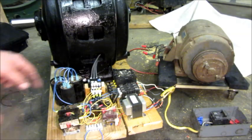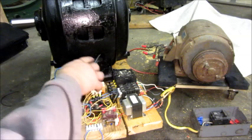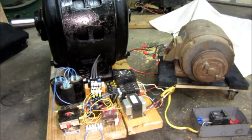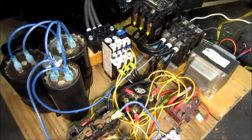So the way this works — over here is a control power transformer. All the switching stuff is 24 volts. Now of course the bigger wires are 240, so I don't want to touch them, but it's okay to handle the control wiring — it's a step down. To give a better idea of how this actually works, it's actually really simple. We'll turn off the input power here.